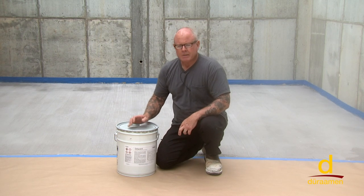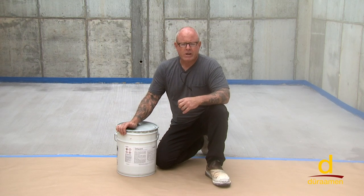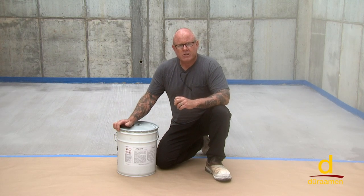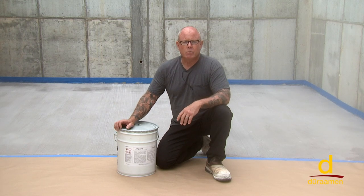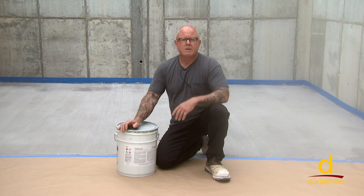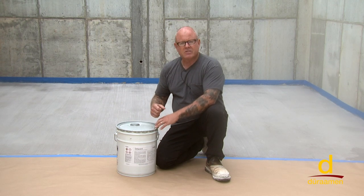This product is UV-stable. It's excellent for a wide variety of different concrete surfaces, ranging from stamped concrete, polymer-modified concrete in this case, patios, pool decks. Now, a word of caution: if you're going to use this product over an area that you're concerned about slip hazards, such as a pool deck, you would want to put a non-skid additive. Generally we use what's called a resin sand — refer to Durman's website for recommended dosage rates, but generally it's somewhere around four to six ounces of resin sand that suspends into the sealer.